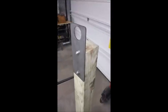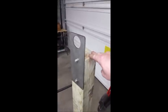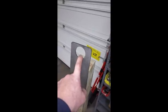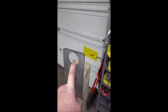The plates at the bottom are identical. Now, while we're back here at the tail, another feature that you will get with this kit is this tailplate. This tailplate will bolt to one of your base columns, which you'd use for your tailstock. It'll just bolt on there, and it gives you a 1 5/8 inch diameter hole that you can put a pipe through that comes off either your aft deck, if you do it that way, or if you're doing a tail dragger, you can just come right off your tail spring. It works fine.